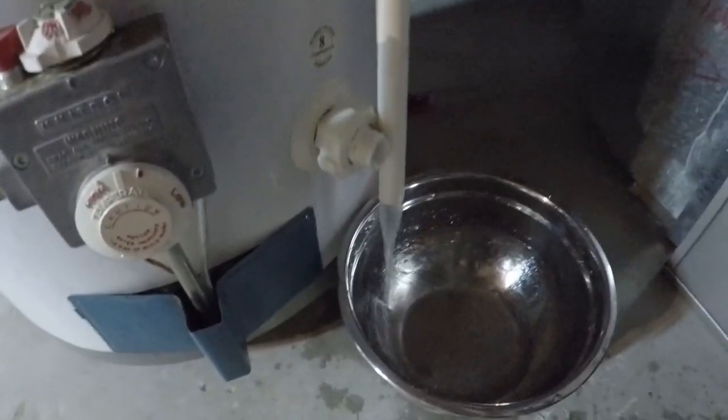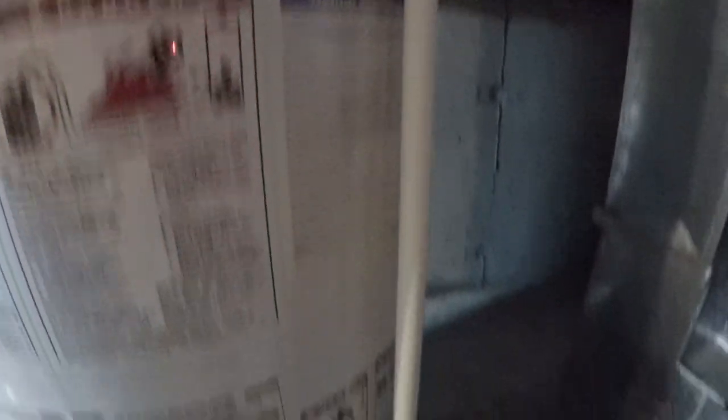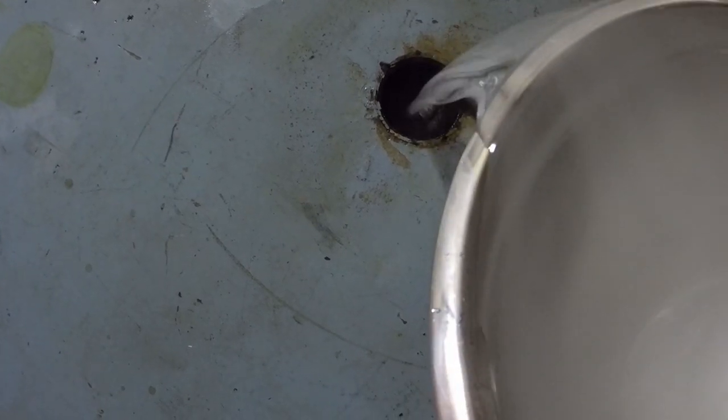If you're down in your basement and you need some hot water, it could be a good time to test your hot water tank's pressure release valve as well. I'm going to do that, and everything seems to be working fine with it. From the previous pan I poured down, the water was standing near the top and moving down slowly — but now I could throw a whole pan down there at once and it doesn't back up in the slightest.